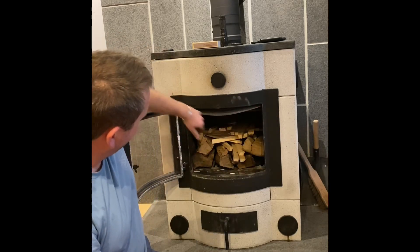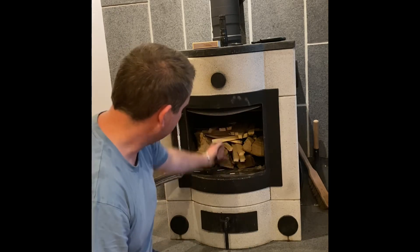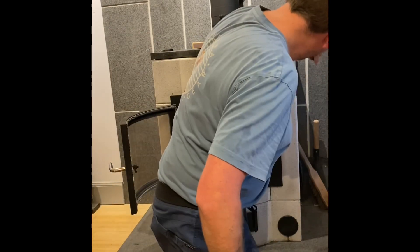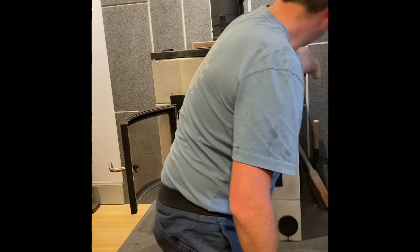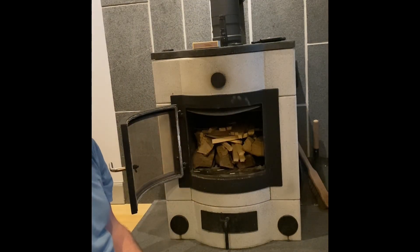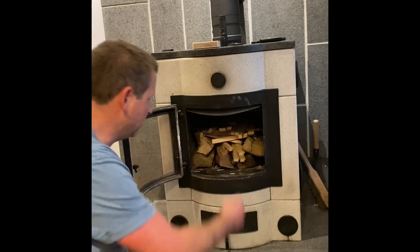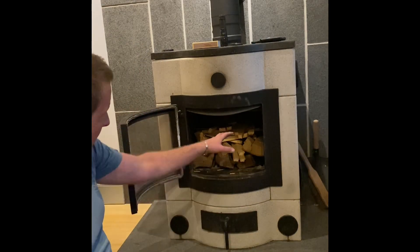There's a rope up here, and what that rope does is stop the gases from being sucked through the wrong path. What we want is for the gases to go to the back of the heater through the plate, come up to the top, down, along the bottom, and back up before going out the chimney — the same on both sides. Also make sure the channels along the bottom are clean — use the brush your manufacturer provides, sweep those channels down, and get the hoover in.